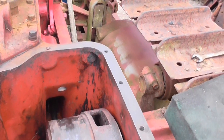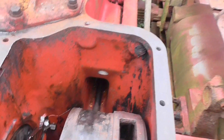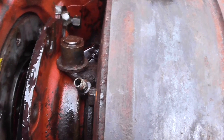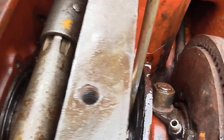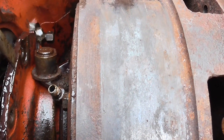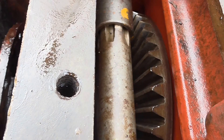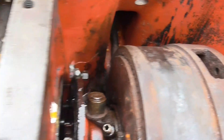This is just an update on the clutch job. The right-hand one is virtually ready to lift but there are some interesting problems. Down on the side there, this bit here is the dog which locates into the drive gear — into the pinion. The original plan was to remove this cover and slide it back. On this side I left it on to show you these ring bolts — six bolts and lock plates — that's how it's supposed to look.